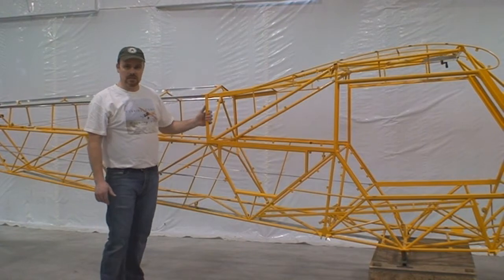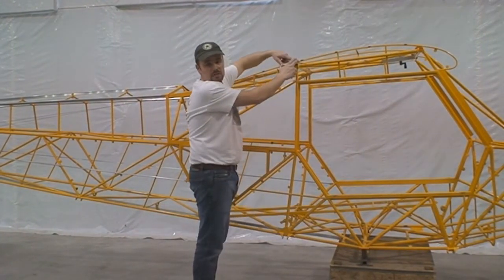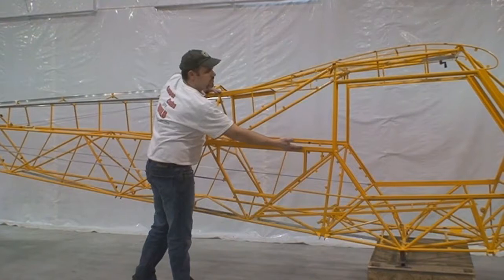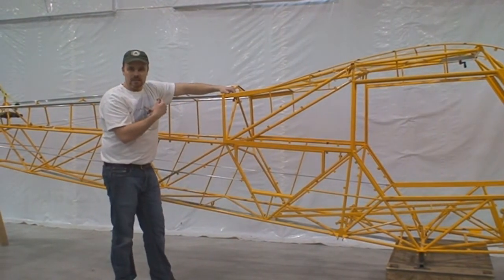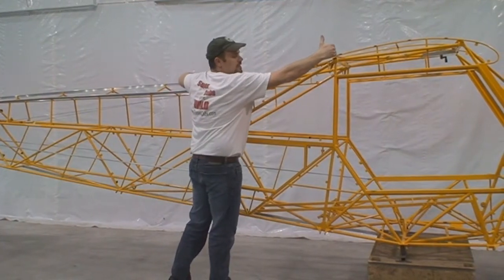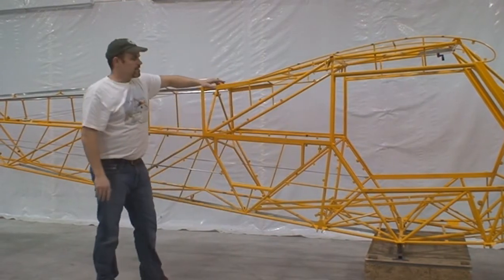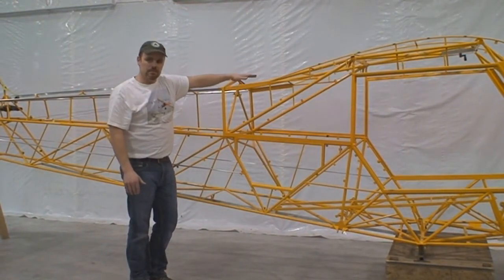This particular airframe has the L-21 style glass, meaning the top of the airframe — on both styles you have a glass roof or skylight on the roof. When you get into the L-21 style, your glass carries all the way back and also comes all the way down, so you have glass all the way around the rear passenger. Visibility is excellent; even the pilot can turn around and basically see the tail of the aircraft in flight. The original Piper style was a C-frame side window, where your fabric would start partway back so you did not have glass on the roof, and on the side you had a C-frame window that came around in that shape. We probably manufacture 50/50 the L-21 and the C-frame. My personal preference is the L-21 just because of the visibility, and Piper did make both styles.